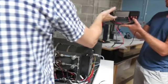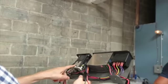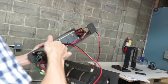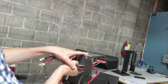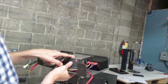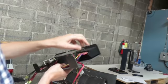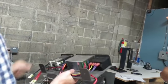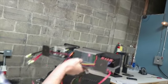This is, and all of them are always laid out this way no matter what machine you order. It's going to be the contactor, which is basically a big on and off switch. When you turn the machine on, that's the click you're hearing. Then this is the AC to DC power supply. Most electricians, you'll hear people just call it a power supply. And then this is the level meter box over here. So this is what controls the level and fill meter on the boiler. So they're always laid out left to right in the same way no matter what machine.